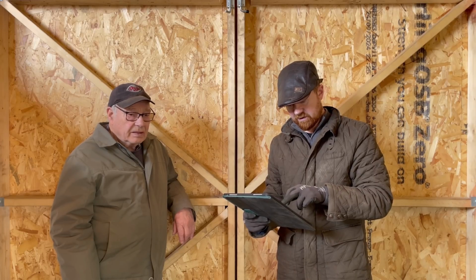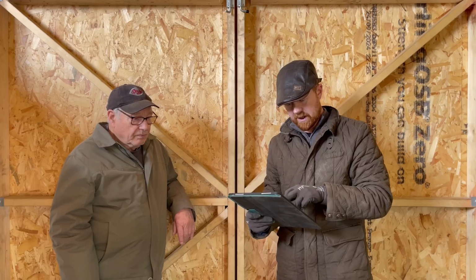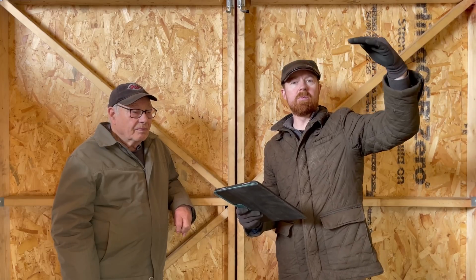Someone else mentioned insulation and condensation on the roof. Obviously you've seen in this one, we'll put boards on the roof. On top of the boards we'll be putting a weatherproof membrane, and then the roofing boards will go on top of that, on top of a lath. In fact, no, they might not need to go on a lath.